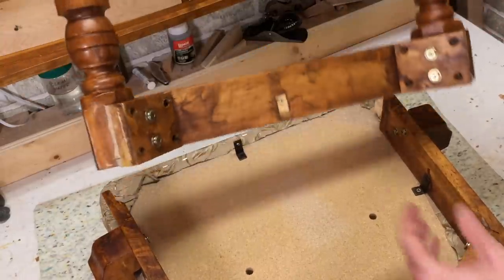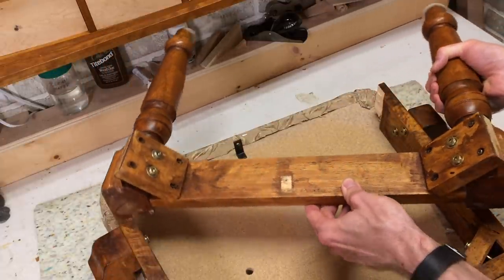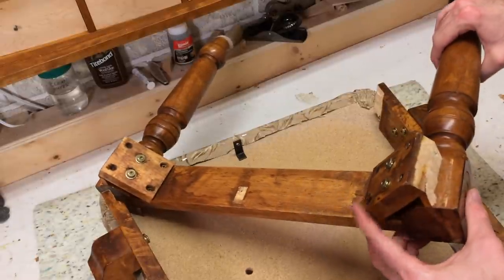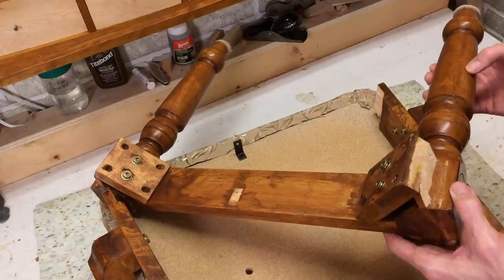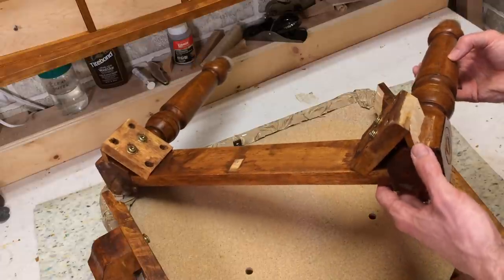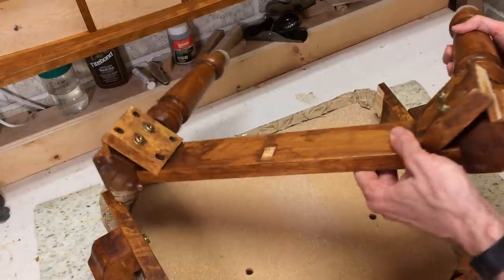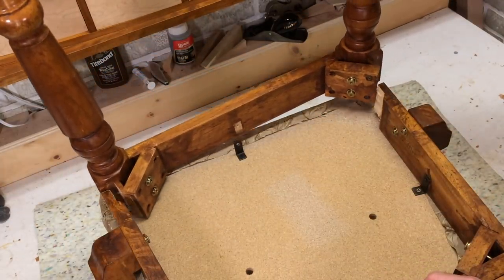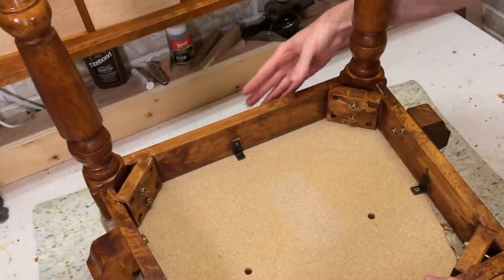The trend I'm starting to see is that the wood being used here is Acacia. It feels heavy like hardwood and seems hard like hardwood, but the problem is it's extremely brittle. So shattering like this is unfortunately not uncommon — I've seen this in a number of pieces. On these two chairs, with the broken arm and the broken legs, the properties of the wood just aren't of the quality that should be used for furniture.